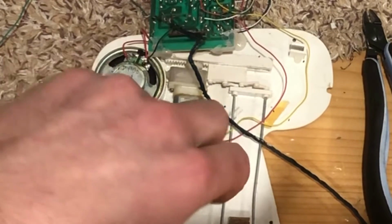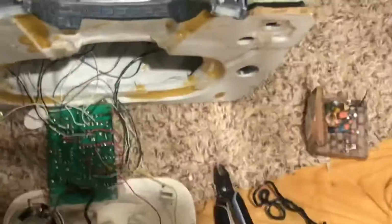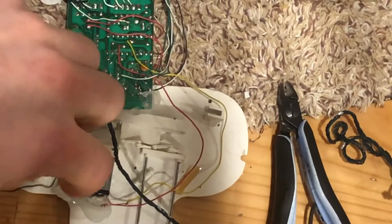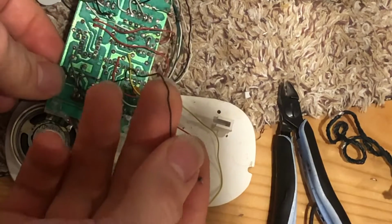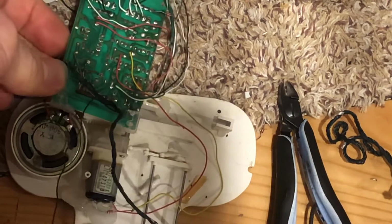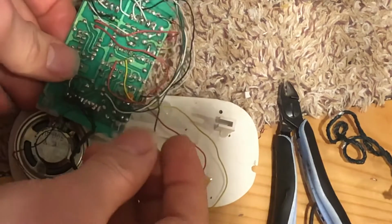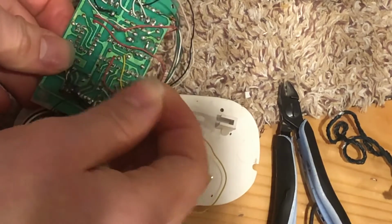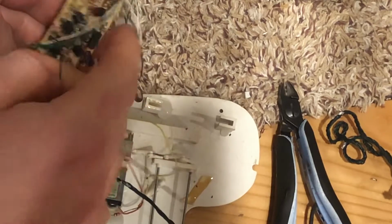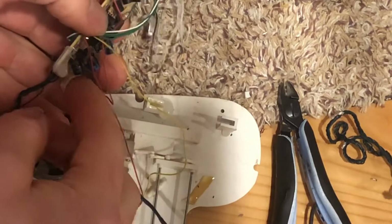Yeah, this one was not originally working, but now the Mummy does function. I also did improve a few different solder joints. I removed this very shady wire here. Reason why I say it was shady is this looks like a junction that someone else did, and I also checked with the other computer board I have, and this does not seem like an original connection, but this wire was attached up here to this point, and that's just one of the transistors right here, and then it goes down to the main PC.